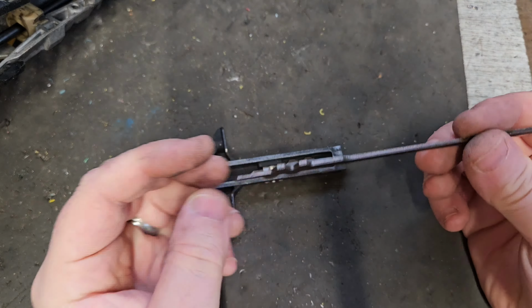That's it together now. We've got to put the chuck back together. On these chucks, same in any drill and these impact drivers, put a little bit of grease in around the little holes where the balls go. Some of these are single balls, some of them are double balls. In fact, this one is two balls. See what I mean. There's the hole there. See what we get.